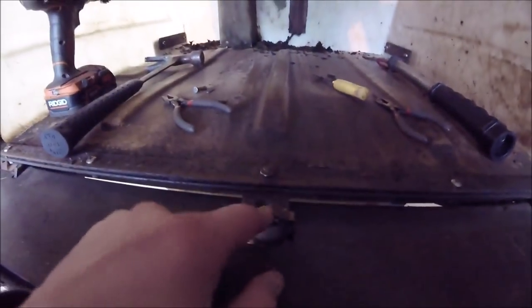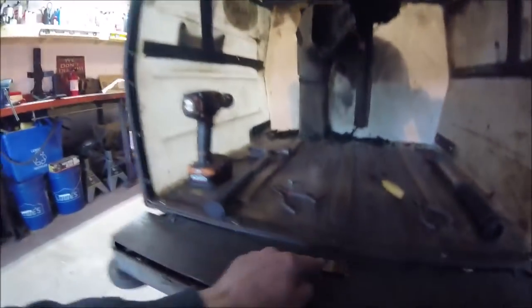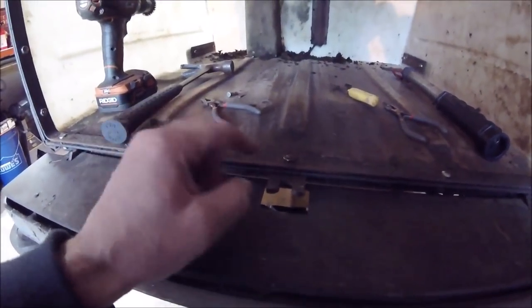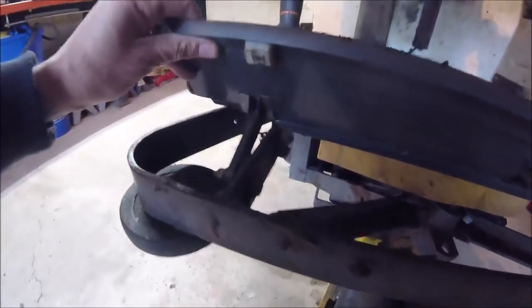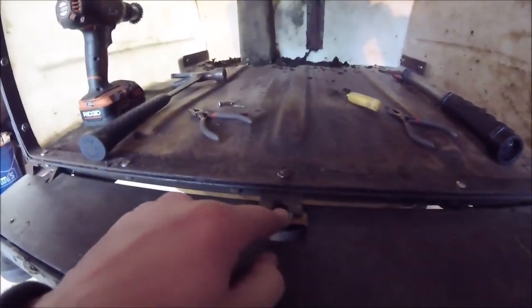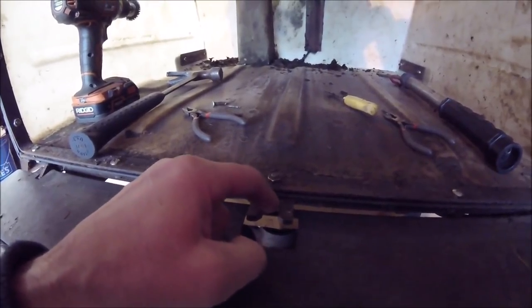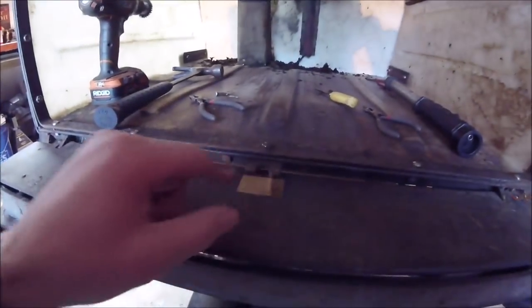This is the groove I was telling you about. There's a bolt that runs through there, but that's just part of it that holds the door trim together — it's welded on. This flap back here — I already took one out. See these little pins with the little cotter pins in them? That's all that holds this flap on. I just took the cotter pin out of this side, so I'm going to pop that one out and take this off. My plan is to come in here with a grinder and grind that a little bit deeper, which will allow that bolt on the lid to go in further.